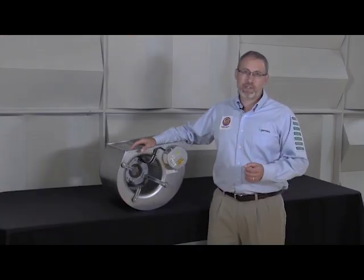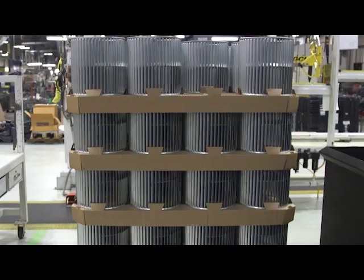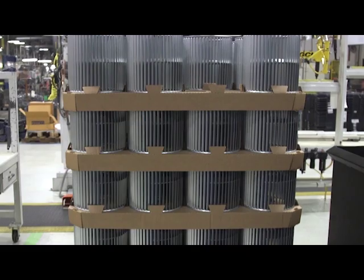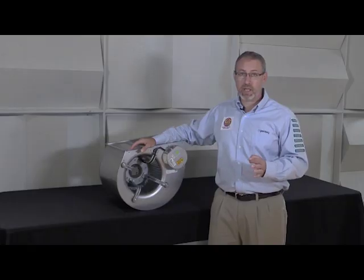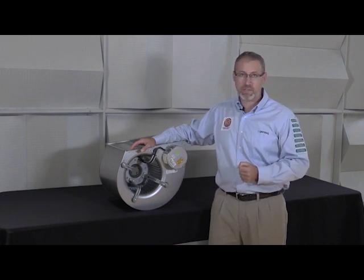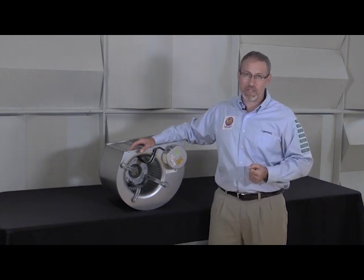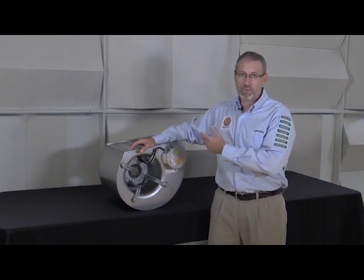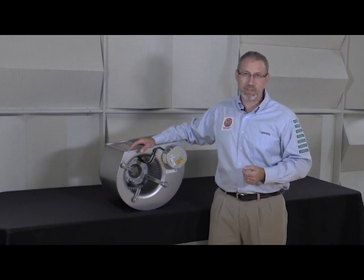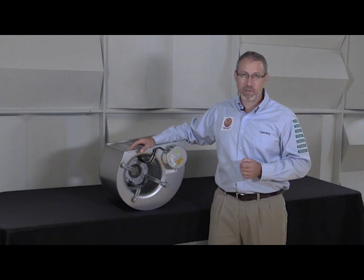As a former contractor, there is one more point I would like to cover: what if the blower wheel becomes dirty and needs to be cleaned? This is also the same as with any variable speed system. Simply remove the entire blower section from the HVAC unit, remove the motor control and any other electronic controls, and rinse with water using a mild cleaning solution if needed. Allow all the components to air dry for as long as possible before restoring power.